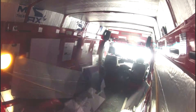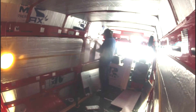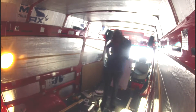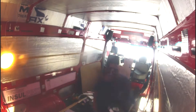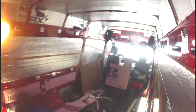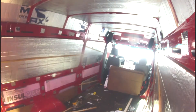In the ceiling and in the floor where I'd like the highest R-value — especially in the ceiling — I don't want to sacrifice height by having two layers of foam, so I'm only putting one layer there. In the walls I have enough room that I'm actually going two layers thick, so I'll have an R-value of about 11 or 12 because I'm using a lot of the XPS pink foam in the walls. I'm just trying to get the highest R-value and most coverage I can with what I have. Once I finish all of this, I'm using spray foam to glue it in.